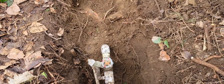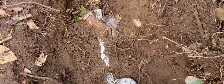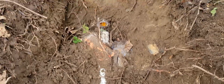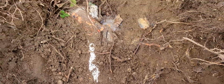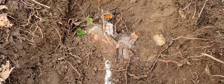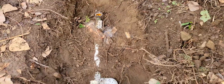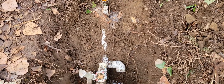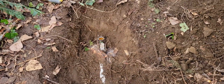Good news — the pipe was right there underneath that big root. I've cut both ends of the pipe so I can push it back underneath the root, because that root is super jammed on top. That way I can cut that root out of there, which should make it a little bit easier to dig. Once I get the root out, I can dig back underneath and trim it up so I can put my valve blocks in there.